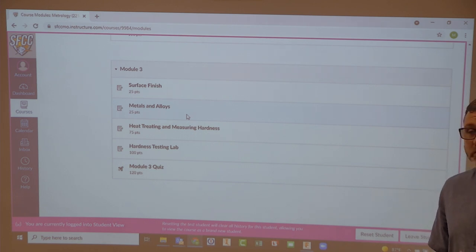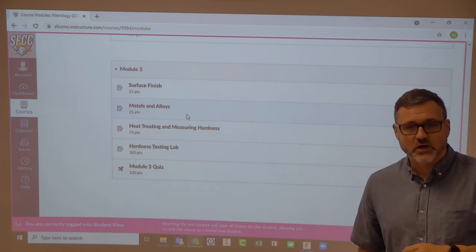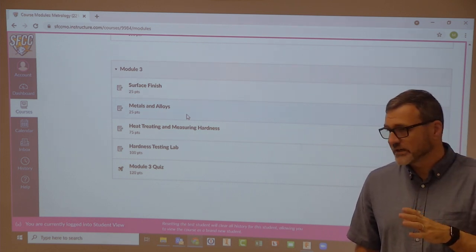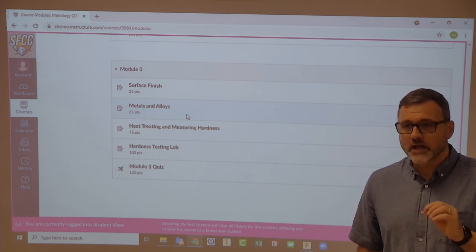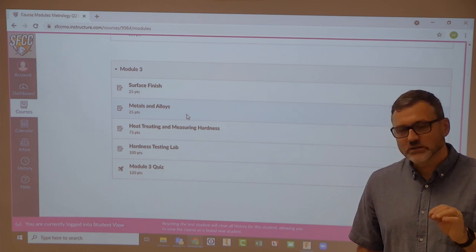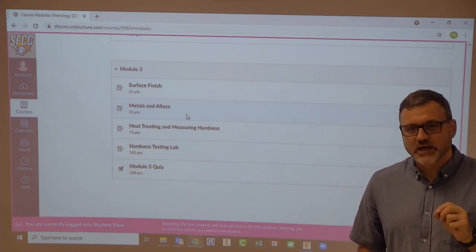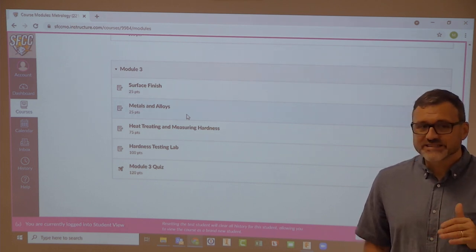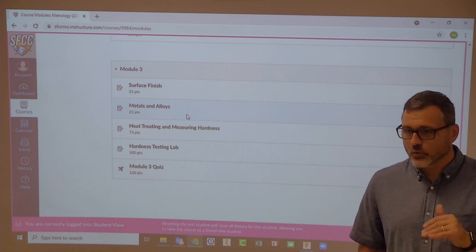So typically our hardness value is going to be primarily rated by Rockwell C. So Rockwell is the standard ABC all the way through, not to Z, but they got several different ones that you can go for. Anything that we cut, which is going to be primarily in the ferrous non-ferrous family, is going to be somewhere on the Rockwell C scale. Aluminum, brass, some of the non-ferrous ones, depending on how hard it is, are going to fall into the B scale. C scale is the standard for most hardnesses.